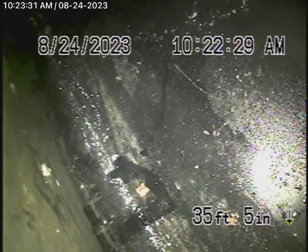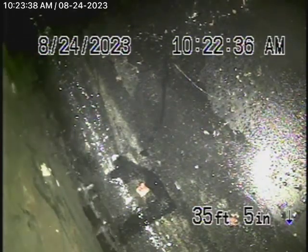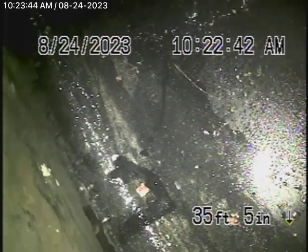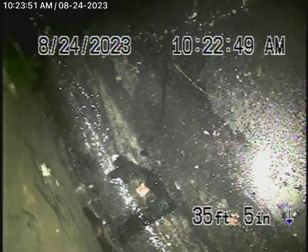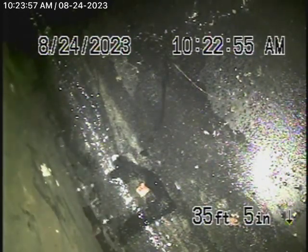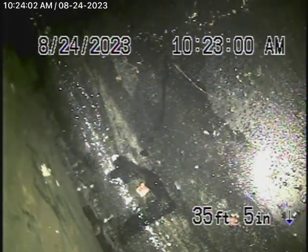You can see the crawl space underneath the house pretty good, and you can see a lot of ABS plastic under the house. We're running the camera from a 3-inch clean-out located on the left-hand side in the little walkway, and this is for the front unit. There are two units here, but they're being sold separately. We have our camera in the line, and we're all the way out to the outside of the house where there's a 4-inch clean-out, and that's where we're tying in — I'm suspecting it's tying into the back unit.